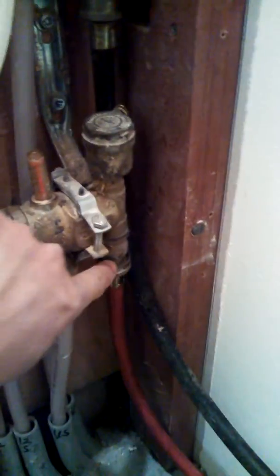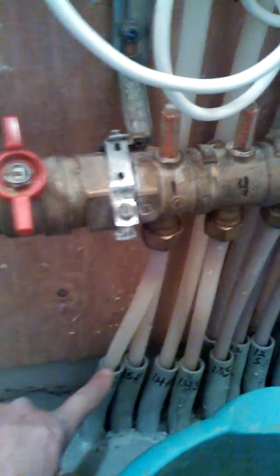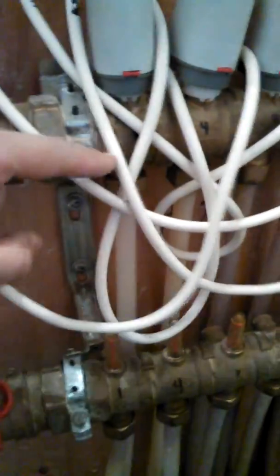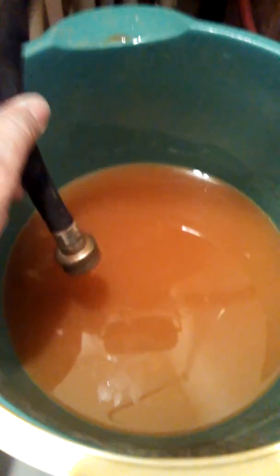On your manifold over here you have ports in and ports out right here. It doesn't matter where you hook up. Basically what you're going to be doing is hooking up your hose here, pushing air in, going across, going over to the circuit that you need, pushing the air through, and it will be pushing the water back up until the air gets to this return manifold and goes up and out — up into a secondary hose, then into a bucket where you're going to be capturing all the water.